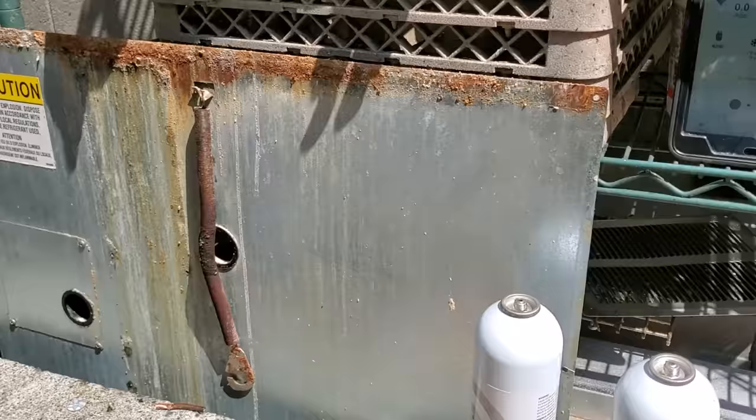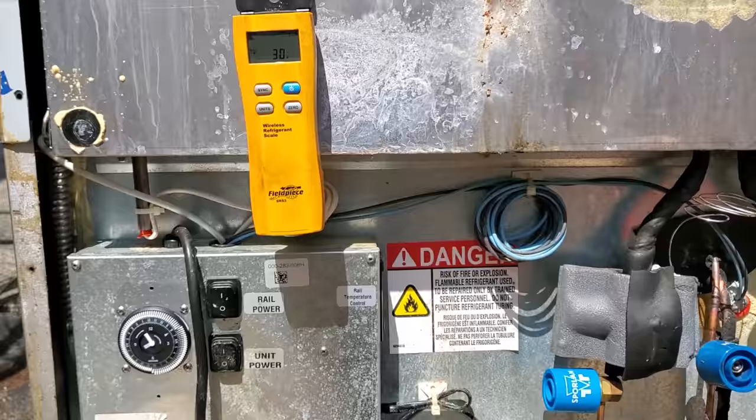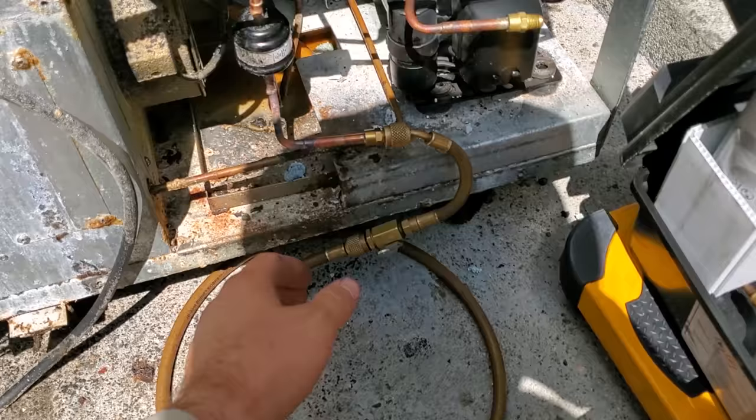Okay, we've got the probes hooked up, connected, ready to go. We're zeroed out, let me zero one more time. Looks like we registered something there. We're looking for 150 grams. I'm touching something. This is what you gotta watch out for when you're doing this really light measurement. See this, I think this hose rubbing up against the scale is messing it up, so let me fix that. Finally, calming down. All right, now we're going to open up the ball valve. 150 grams is what we want.